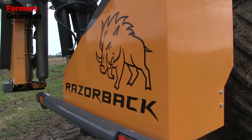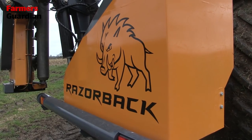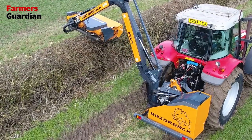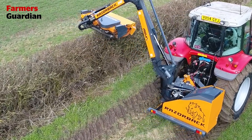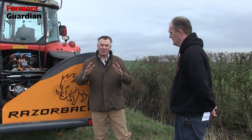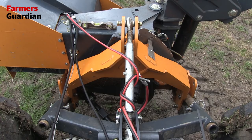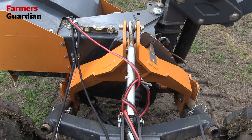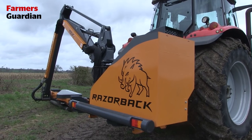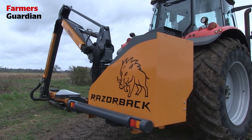For a few years I've been thinking about hedge cutting and doing our own hedge cutting on the farm, and I felt it was time to move on a little bit. What we've introduced into this machine is a connection between the main frame of the hedge cutter and the rear frame. Between the linkage and the rear part of the machine we have a pivot, so as the tractor rolls and rocks with the changing contours of the ground, the head will maintain a level contour to the hedge.